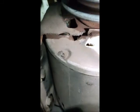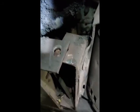And that's completely sheared off the pin there, and it's walled out there. And that's why the belt broke. Okay, so we'll have to do some fixing on the bracket here to get them up and running. We'll turn that motor, get it kind of straightened up, and see what's going on. Maybe the pulley is completely chewed up. Kind of hard to see. It's a little wallowed and uneven. Okay, all right, start getting this taken apart.